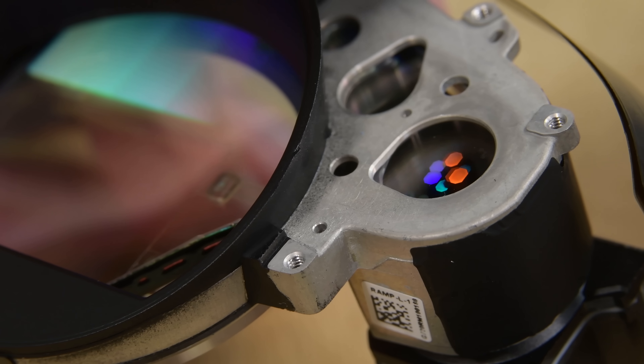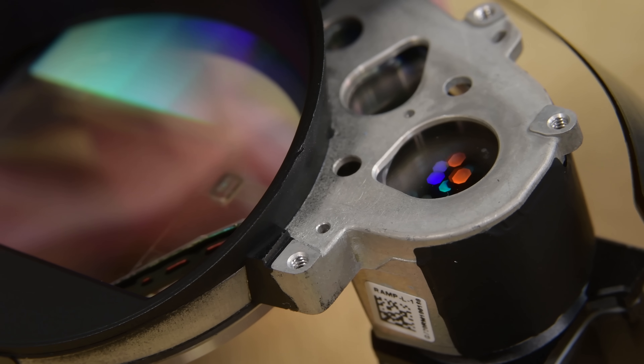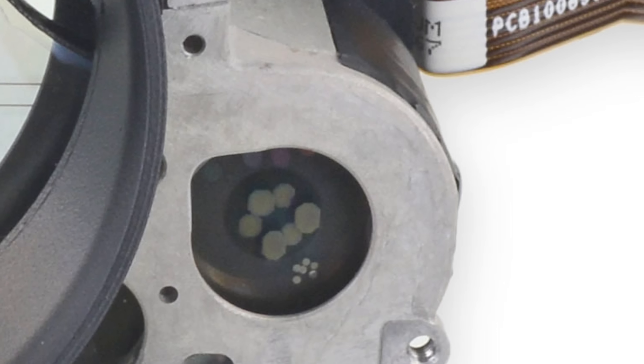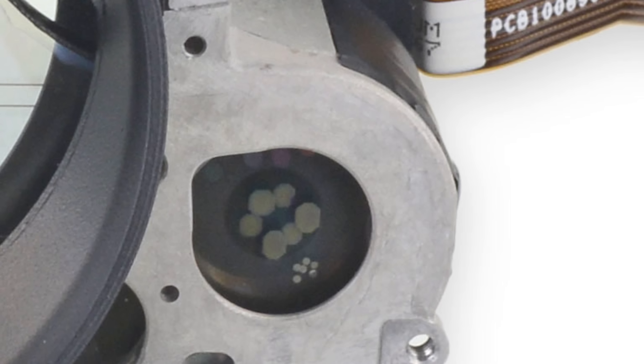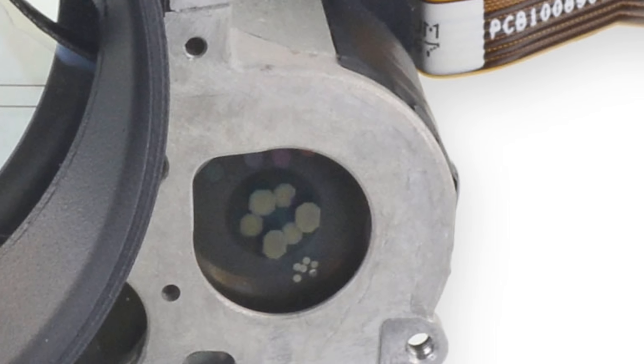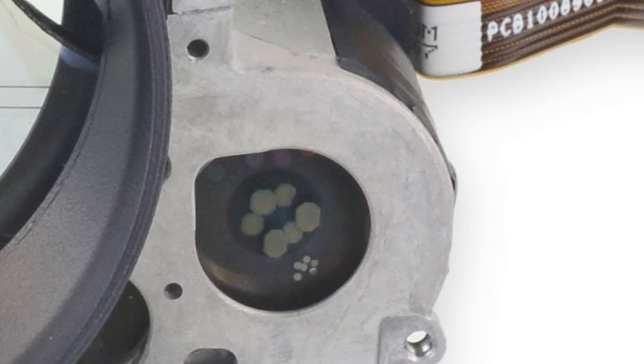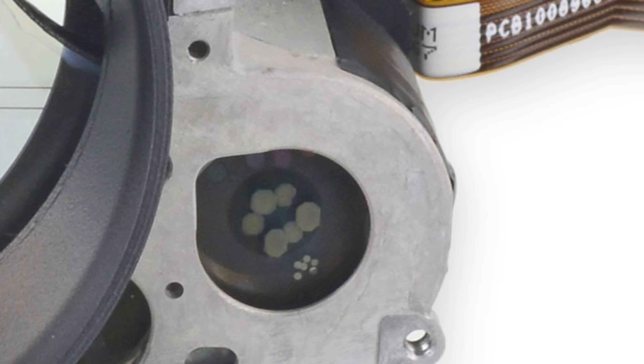This colorful window is actually the optical system for injecting two sets of red, green, and blue image light into the diffractive waveguide, with each of the two sets handling a different focus plane. The bright colors on top are not indicative of specific color channels, but rather result from ambient light reflecting off the diffraction gratings at an angle.